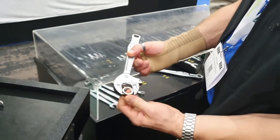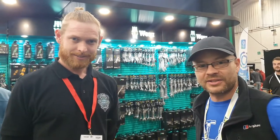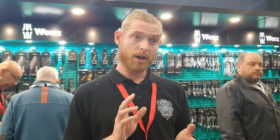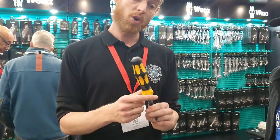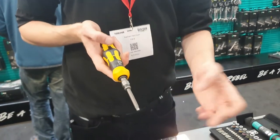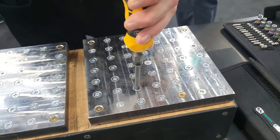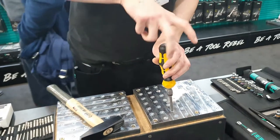So hi, we're here with Nathan from Wera Tools, and he's going to show me and show you a brand new innovation that's just come out. Yeah, it has. So we've done our innovation launch. We do that at end of February, March time every year, bring out a load of new products and new innovations. And one of them is our new KK900. It's a chisel driver. So the idea behind it is you're able to strike it and it's impact rated, you're able to lock it off in order to redress a screw. So if I had a really damaged screw that I wasn't able to get a turn on, I can put that in and I can strike it locked off, which will redress the fascia of the screw, which will allow me to turn it out.